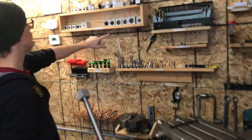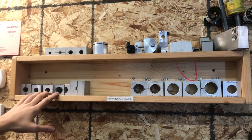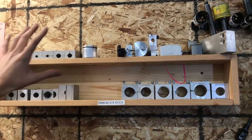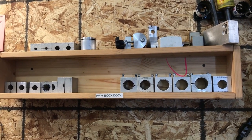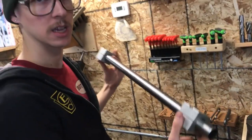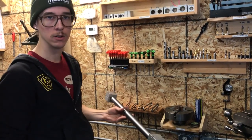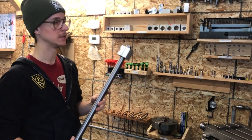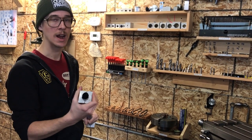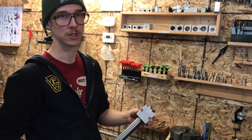I have a collection here — this is my Paragon Machine Works block dock. I probably have $200 or more invested in these blocks that I bought years ago and have added a couple over the years. It's just been really valuable to have these on hand so I can quickly and easily hold tubes and get the cuts made and finished. I also sometimes use them to hold the tube in the vise while I drill for water bottle holes. They're useful for a lot of things — just being able to hold fractional inch tubing and round stock, these come in handy all the time. Even if you plan on getting a more sophisticated mitering setup, these are not a bad investment in the frame building shop.